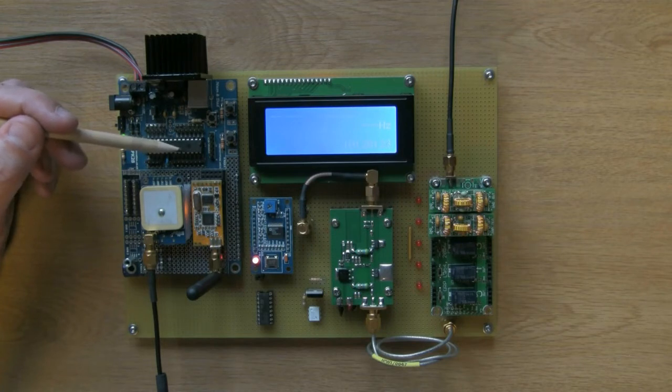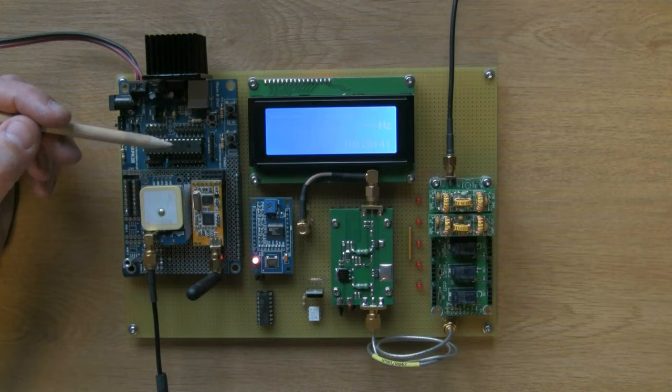I personally use a PICkit 3. I've never had any problems with it. It's been brilliant. I don't tend to use a lot of in-circuit emulation or anything like that. For debugging, I tend to connect a serial interface to the PIC and then use trusty printf statements to print debug information over the serial interface. I find that a lot easier to use than in-circuit emulation.